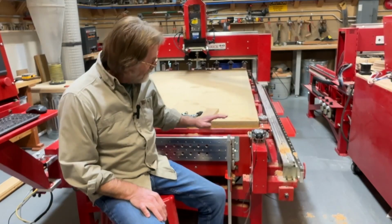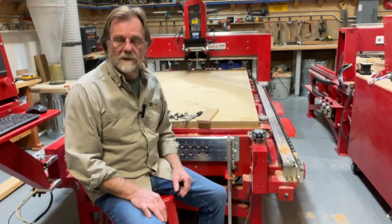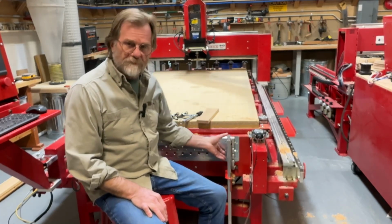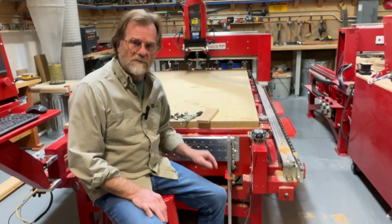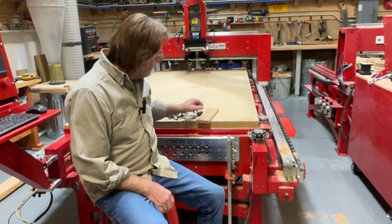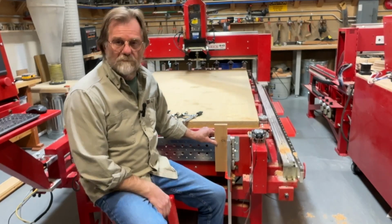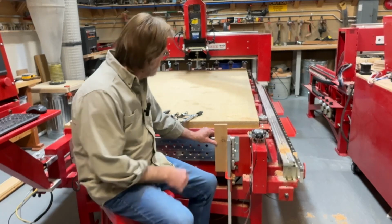Now I'm going to use the vertical joining system, set at 90 degrees or perfectly vertical. I've set up a fence in here, and this fence goes just to the floor. It has a stop that I can raise and lower, so that each part, as I put it in, will come to exactly the same position. Makes it easier as I'm doing production work.